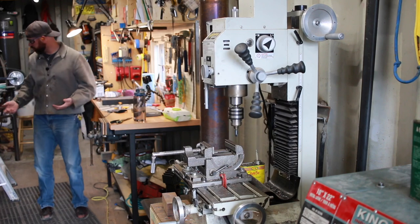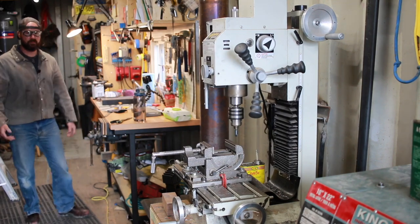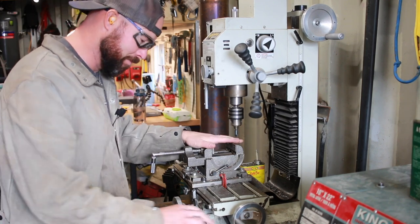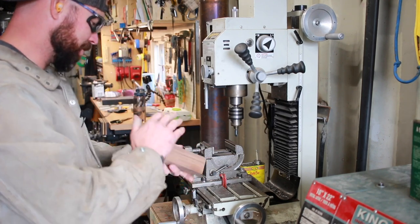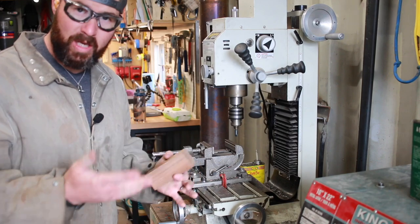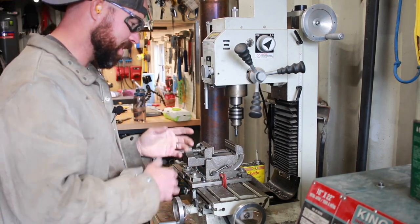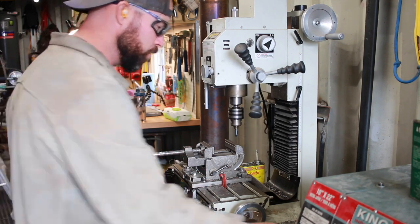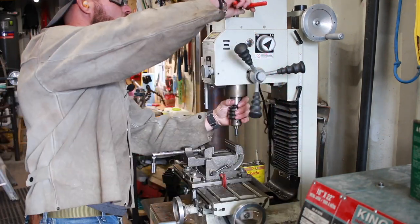Oh, where did I put the black walnut? Oh, duh. Just need to put an end mill in here. I'm gonna use my milling machine to true up this block. Then I'll cut it in half to get two scales, but I'd like it all trued up first. And then again, I'm gonna put it in after we cut it just to make sure those surfaces are really, really flat and smooth. So let's go ahead and swap this thing out real quick.